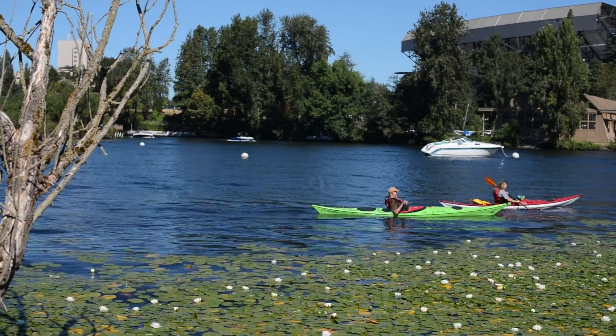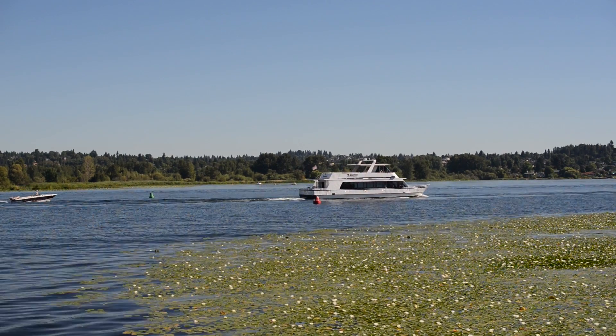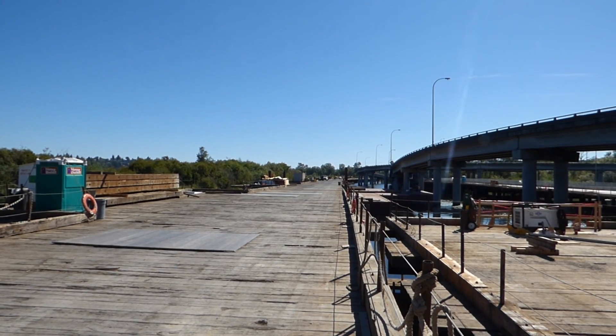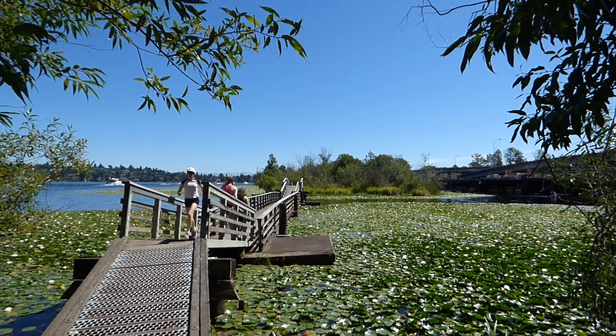You have to worry about in this location endangered salmon that swim between April and September, running right parallel with this bridge. So that means there's no impact hammering — that's what we use to drive the thousand piles for the temporary work bridge and for the widening that we have. So between the salmon and all the aquatics, we have to make sure that we maintain water quality standards.